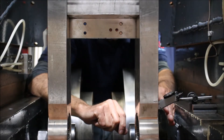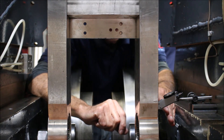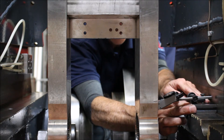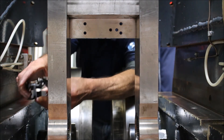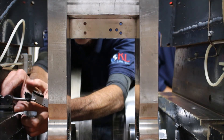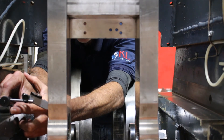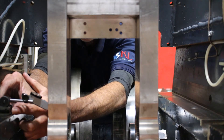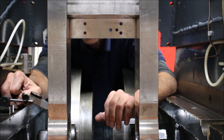After we've established our original zero and confirmed 14 to 20 thousandths running clearance, we need to gently remove the indicator from the original side, move it to the opposite side, and engage the indicator with the upper idler. Remember, we're looking for 0 to 5 thousandths. Right now we're at 4 thousandths — that's in tolerance.